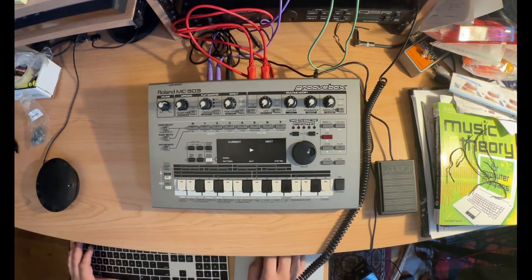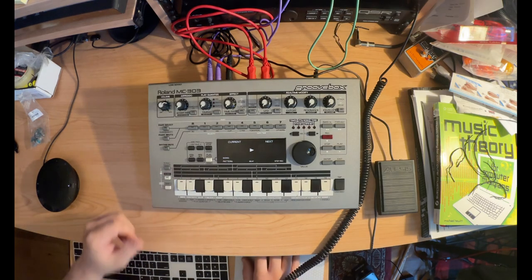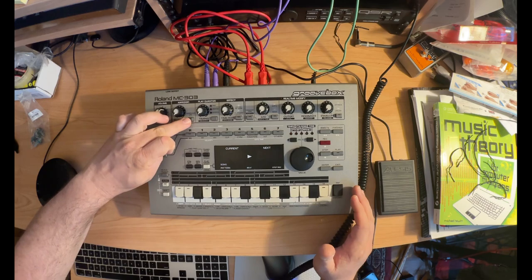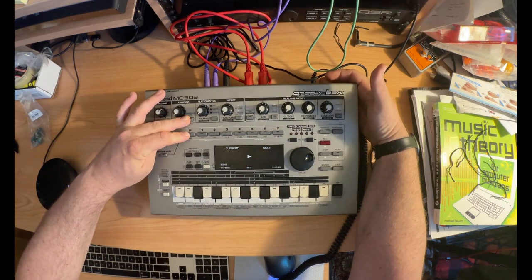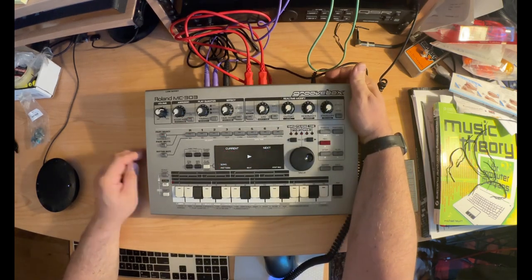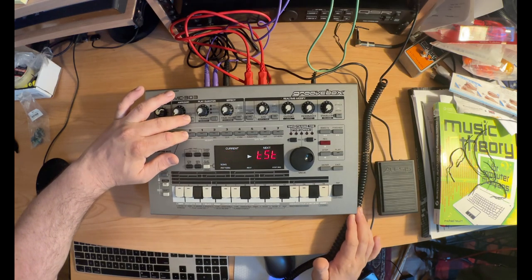Because what's going to happen is on basically the fourth or fifth test that's performed, it's going to test the MIDI interface and then have you unplug the cables. So the first thing you'll need to do is hold down the arpeggio on button and also the rhythm part button at the same time while you turn the device on. Actually, you need to hold them down while you turn it on, so I gotta hold it. Okay, there we go. Now we're in test mode.